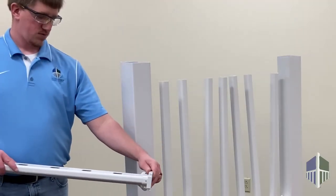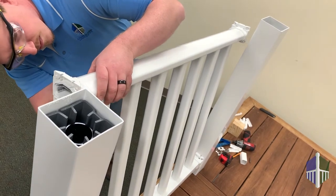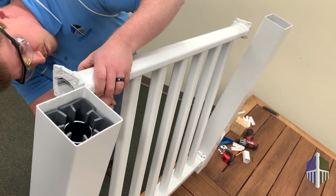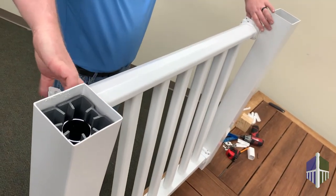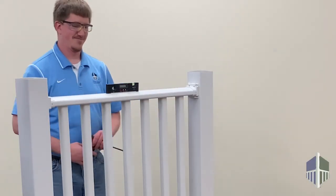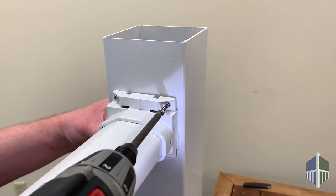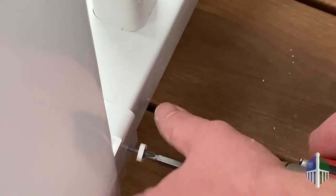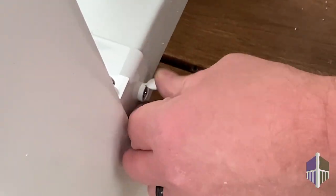Install the top rail. Place brackets over each end, then slide the balusters into the top rail. Make sure they are installed all the way before moving the top rail into place. Make sure it is level, then attach the fasteners. Add the self-driving rail screw with hinge caps, then snap them to conceal the screws.